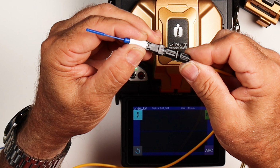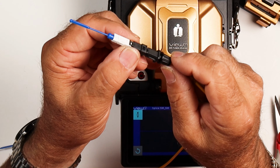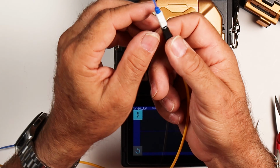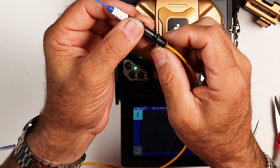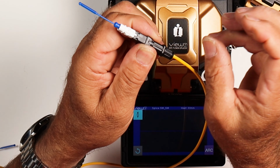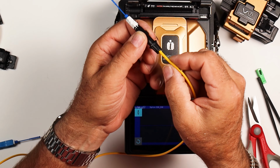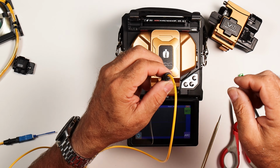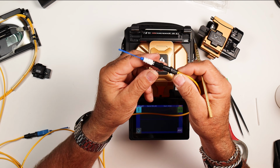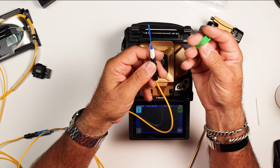And then gently, without putting any undue stress on, we're just going to push on here and get it up there until it clicks into place. All right? Once you're done there, just tighten this guy up, and he pushes those pawls in and squashes against the 3 mil, right? So you can see down here where he's actually grabbed on and got the 3 mil, but he won't crush the fiber. All right. Once that's completed, throw on your housing.